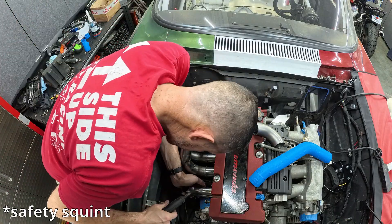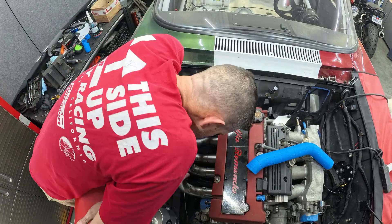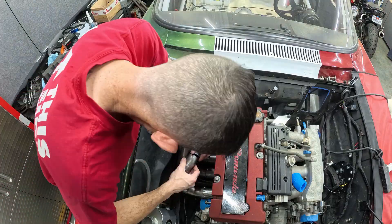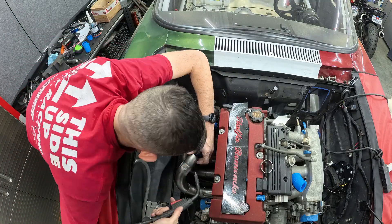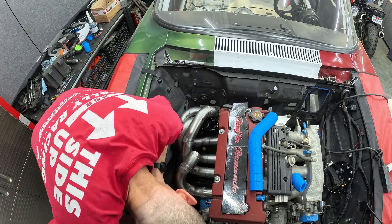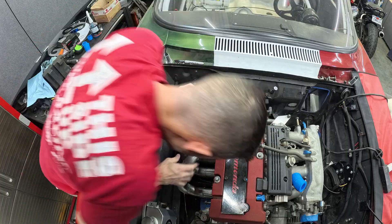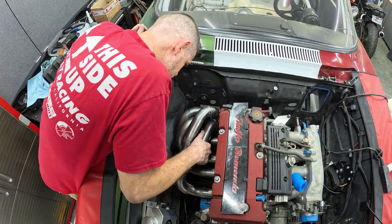It's really just a matter of going through one by one — a lot of trips between here and the bandsaw, taking a plastic piece, making a matching metal piece, coming back, tacking it on, and adjusting the fit as necessary. I specifically laid these out going from the rearmost cylinder to the frontmost cylinder because of how they lay on top of each other — you're really only going to be able to get them in from one direction.